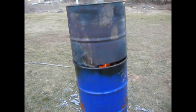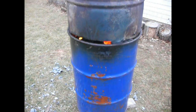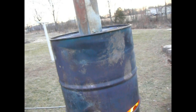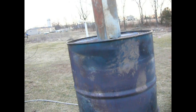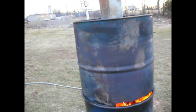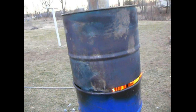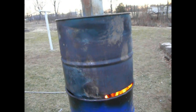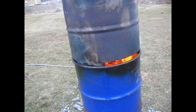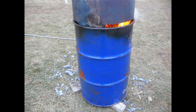It's getting dark out here, and looks like the charcoal itself is burning well as far as I can tell — I'm certainly no expert; this is my first time making charcoal. I used the barrel size I had, and because it's so tall, the heat from the fire is having trouble heating up the whole large area — it acts more like a cooling fan than a heat chamber. I think I should have made it about six inches tall, especially for a cold day. I'll probably cut it off for the next burn, but I'm going to let it burn down tonight and douse the charcoal with water when it's finished, then see what I've got tomorrow.